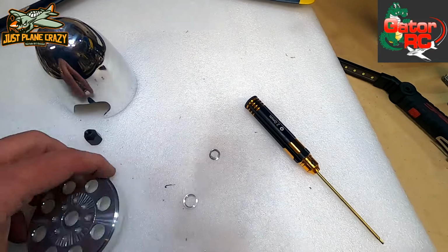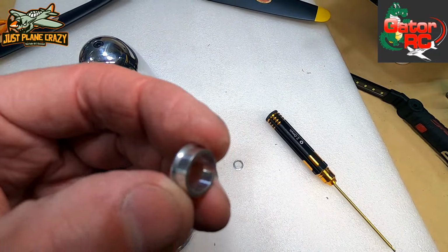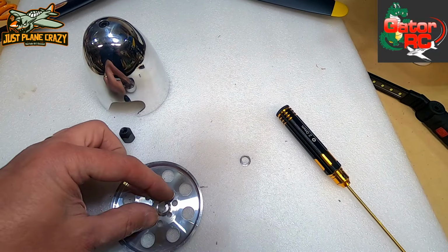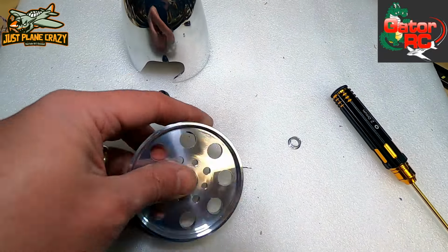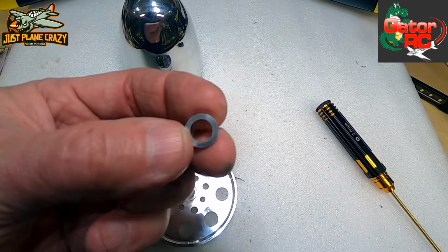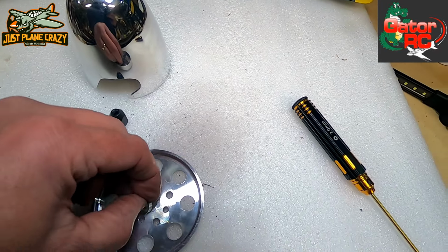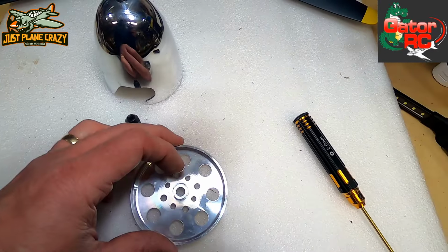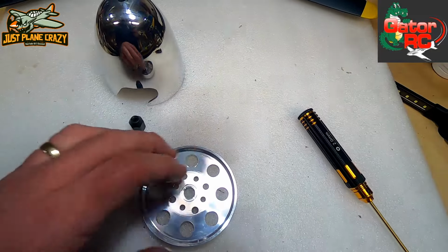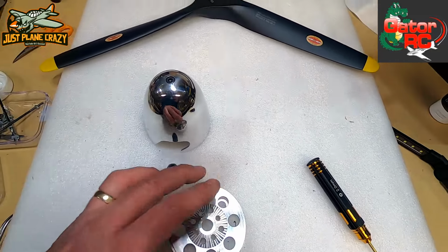But look at this. On the back side, this one is shouldered, and that one fits perfectly on the inside of there. And in case you have a smaller diameter shaft yet, there's another spacer that perfectly mates in the inside of that one. The ability to get all that stuff machined perfectly on center and not have any play is amazing.